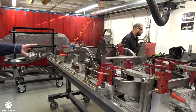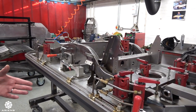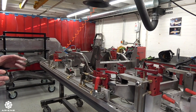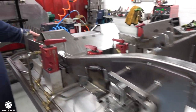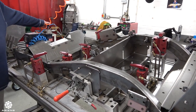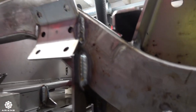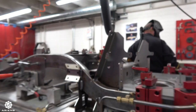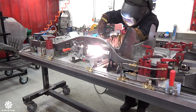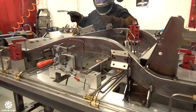Step 8: Chassis Fabrication. In here all the parts are assembled and put onto this special jig system that has been designed and is used in the USA factories of Ariens and Gravely. It's been specifically designed to hold the chassis in place, with quick release and clamping mechanisms for easier working conditions. The table has been specially designed so that it can be moved and rotated for easier access to the different areas for welding. The thought and consideration that's gone into the design and engineering of this jig system itself reflects the high quality standard in the production process.